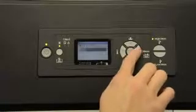The next option in the test print menu is the job information. Once we execute the job information test print, the GS6000 will automatically print job information for the last 9 jobs that were performed on the GS. It will contain information on each individual ink cartridge that is in the machine and how many milliliters per the 1/10 of a milliliter were used for that specific job. It will also print out the width and height of the media that was used for a specific job.